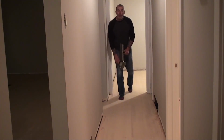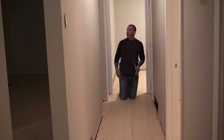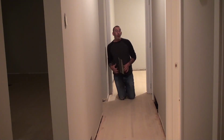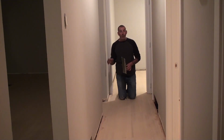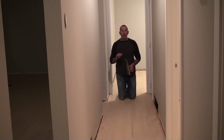After a long day of sanding off the original finish of this floor with my large machine, using a 40 grit sandpaper to strip that all off, once I got the heavy stuff off in the bigger areas, I used my orbital sander around all the edges, using a heavy grit sandpaper as well. It gave me a really nice stripped appearance to the oak.